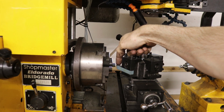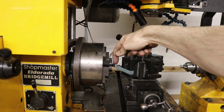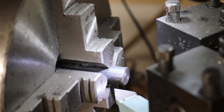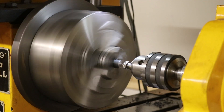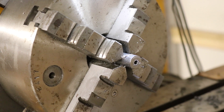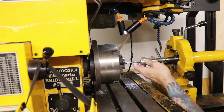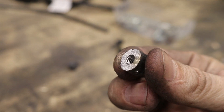The first thing I'm going to do with my little rod in the lathe is face that off — clean off the front face so that it is nice and flat on the end. With that done, I'm moving on to drilling a hole through it. Our hole is now drilled, and I've got my little tap on the end of it. I've now got two little threaded nuts.